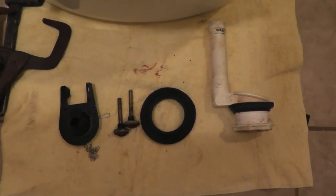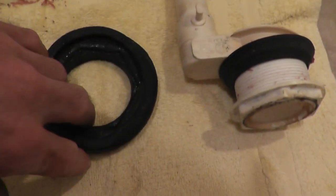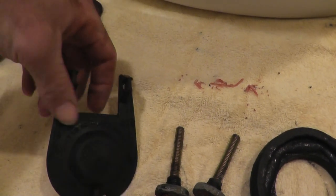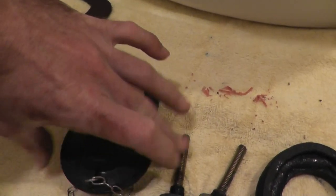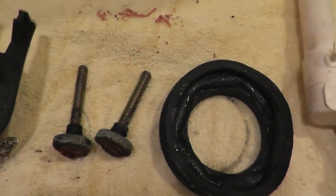Here's an outline of what I need to replace to get the old commode back in top form. The main part that's faulty is this valve assembly — it has a big crack in it. This gasket that goes between the tank and the bowl is also bad; water was leaking past here when I flushed and actually onto the outside of the toilet. The bolts are still functional but they'll likely come with the rebuild kit, as will the flapper. When I first noticed this toilet had a problem, I suspected the flapper, because oftentimes those are the problem with a leaky toilet — they get warped and don't seal properly. I replaced the flapper and it still leaked, and that's why I'm in this situation.